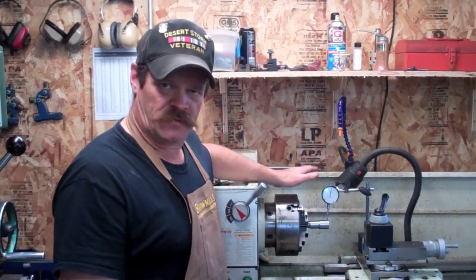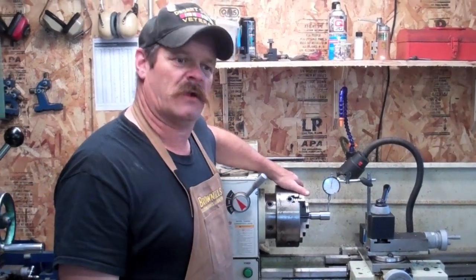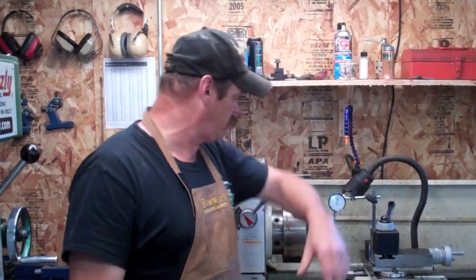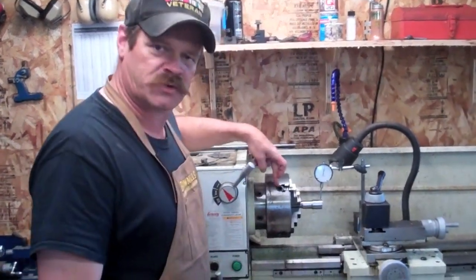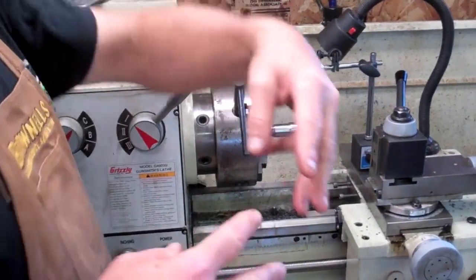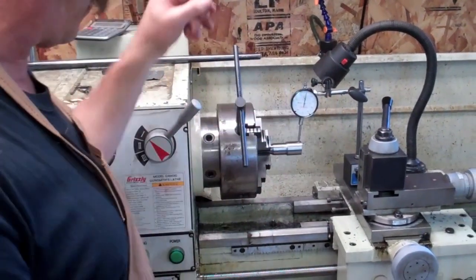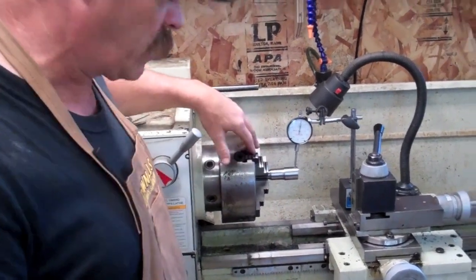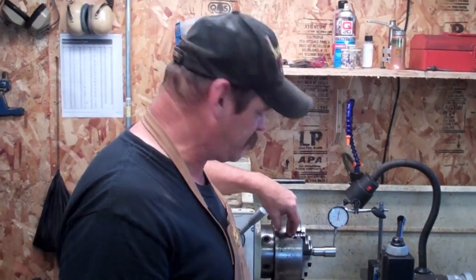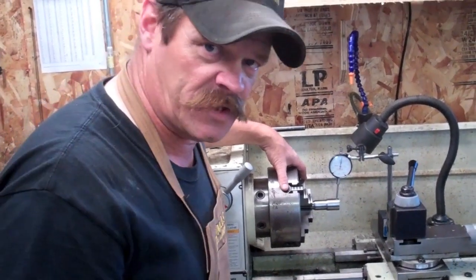So what I've done is I took the three-jaw chuck out and we have the four-jaw chuck in. A three-jaw chuck is a scroll — each one of these little bolts, you turn with the wrench on a scroll chuck, and that means they all move in at the same time together. On a four-jaw, specifically an independent four-jaw, each one of these has a bolt. You turn that individual bolt and just that jaw moves in and out only. Let me show you how close we got the tolerances on this one so far.